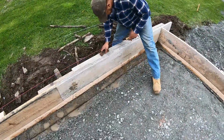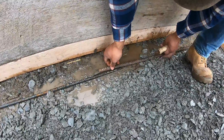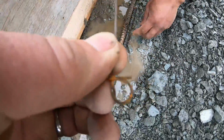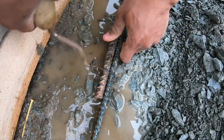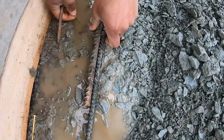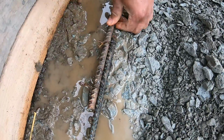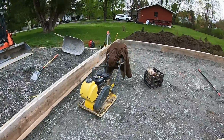All right, so here we are. Here's the rebar. Show you how it gets twisted on. We usually twist two twisty ties on each. There's 2 hoops, 1 hoop there, 1 hoop there. Loop it around, hook it through, and then twist it. She's done. We do 2 on each bar, sometimes 3 if it needs to be, but calls for 2. And there it is. Do that all the way around, and then we install the wire.